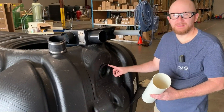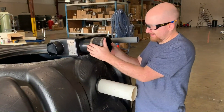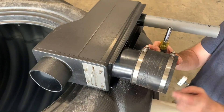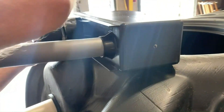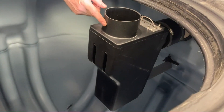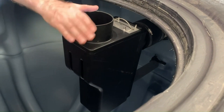After inserting your 4 inch gasket, we're going to put another section of 4 inch S&D pipe. Then using a 4 inch by 4 inch fernco, we're going to install that onto the multi-siphon device until it is approximately halfway into the fernco. From inside the tank you'll need to install the multi-siphon overflow device onto the pipe and tighten down the other end of the fernco. Make sure that the stabilizing brace below is making good contact with the tank — this will keep the multi-siphon device from tipping and not allowing the water to flow properly.